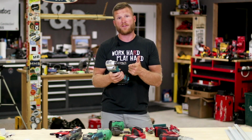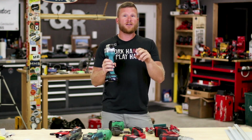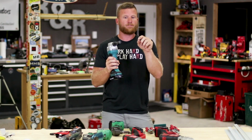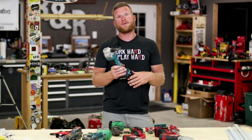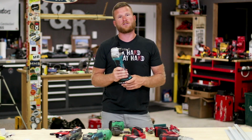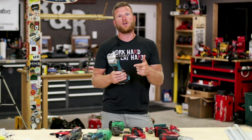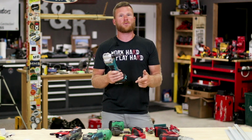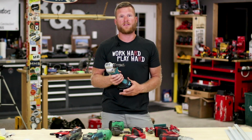The only problem with these is that they leave what we call niblets, because it's punching these little nibble bits of steel out and they kind of go everywhere. They get in your shoes. That's just a horrible, horrible mess. So you've got to definitely be careful where you're at. You don't want to be doing it over top of finished product because it will ruin the finish if those little pieces get on there and you rub it and they scratch.